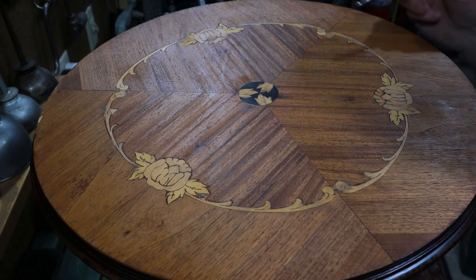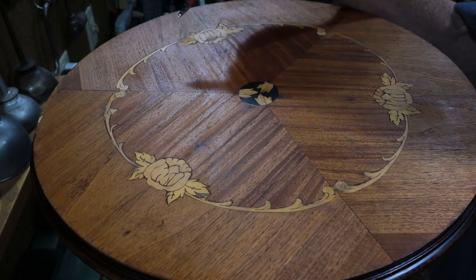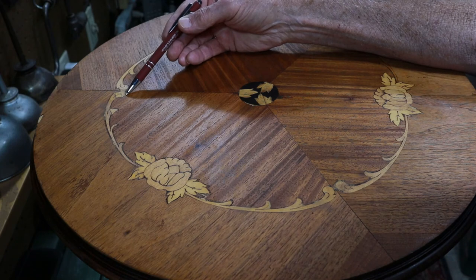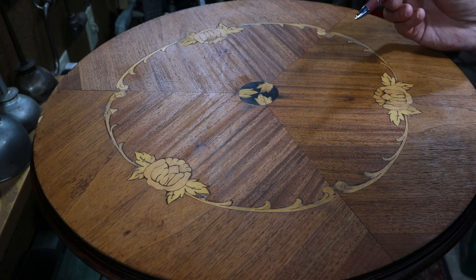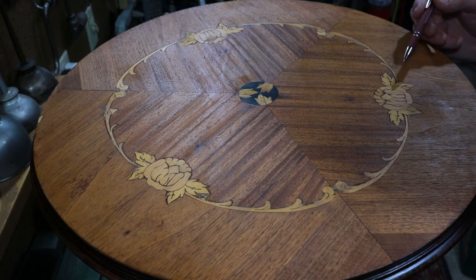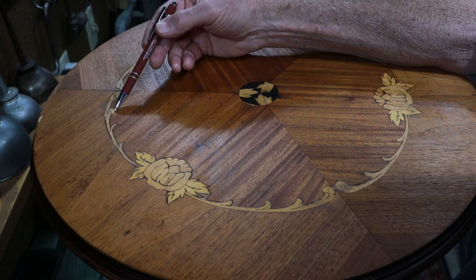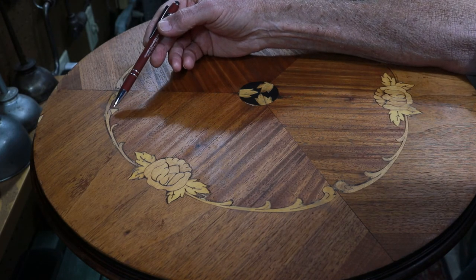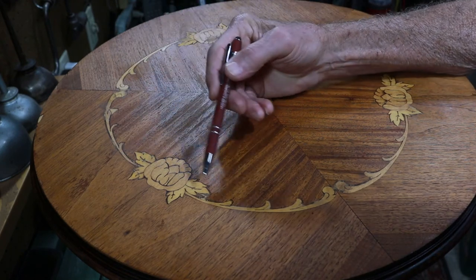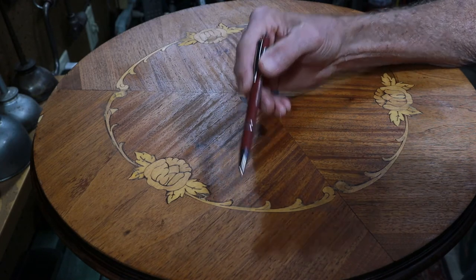I did use a wood filler because the spacing on some of the repairs left a little bit of a gap, and there were also some gaps in the original inlay that chipped out while I was doing the scraping — those left light streaks. I'm pointing out the areas that are new, and I'll try to shade those as I go along. This line here has a little light spot, and this entire line is a bit light, so it needs an accent.